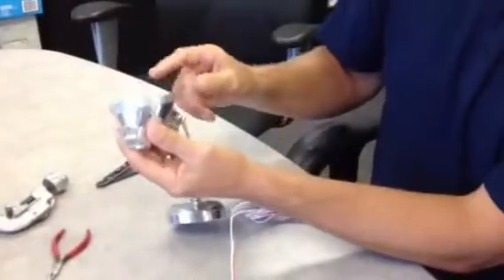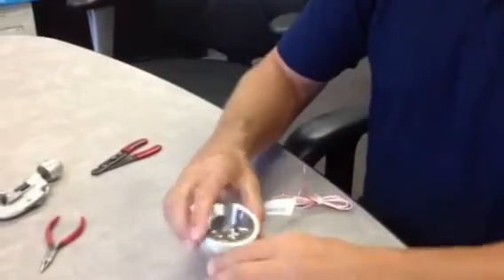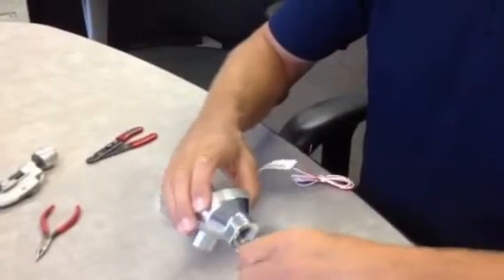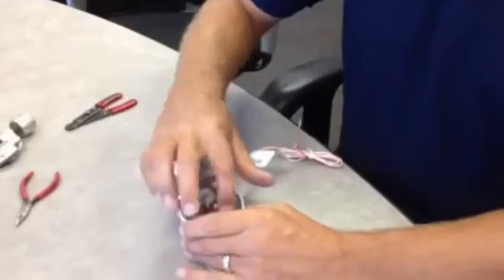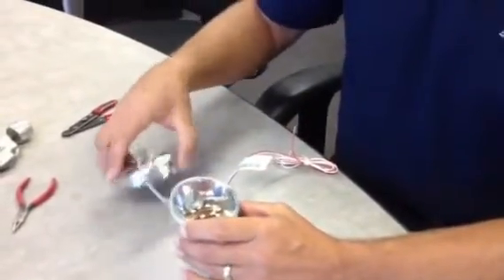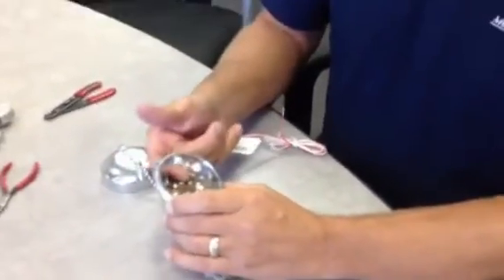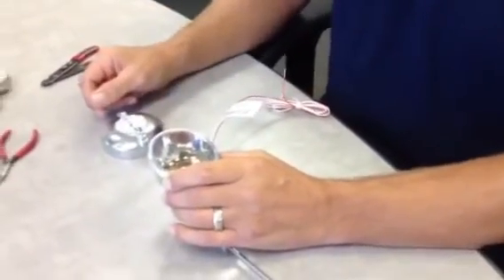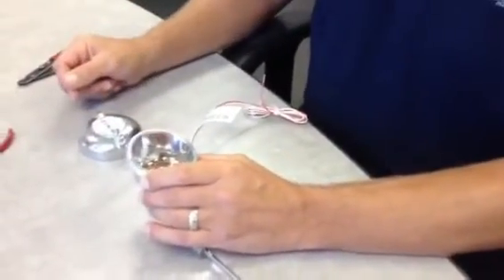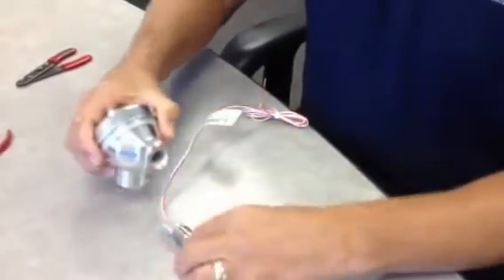Then thread the lead wires through the opposite side from the opening and screw that onto the thread on this side of the fitting. Make your wire connections onto the terminals. The customer would usually make their connections through conduit onto the terminals on the other side or onto the same side where the RTD wires are. Screw that back on and you have a complete bearing assembly.